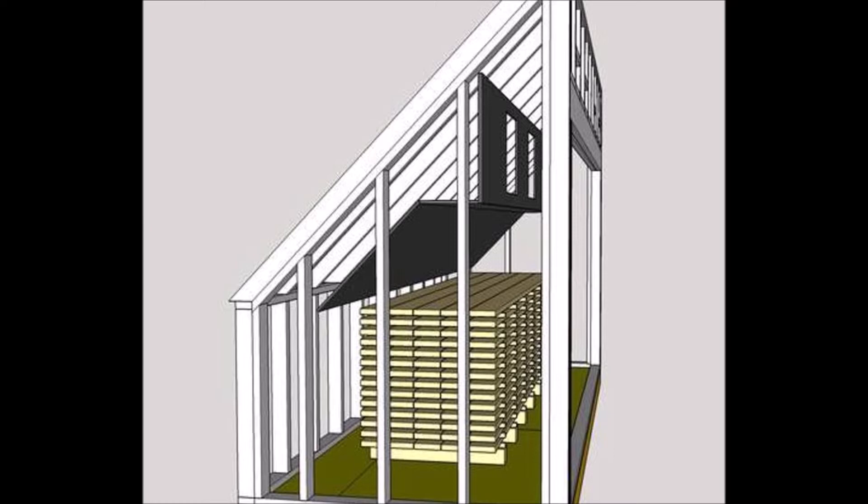In this picture, note that there is a short front wall approximately 32 inches in height. The back wall is approximately 100 inches. I say approximately because the angle of the roof should match the latitude of your location. Because the sun changes position throughout the year — high in the summer, low in the winter — any number you use is only ideal for a few months at best. Because it's easier to build using standard construction angles, I chose a 45-degree roof for my kiln.